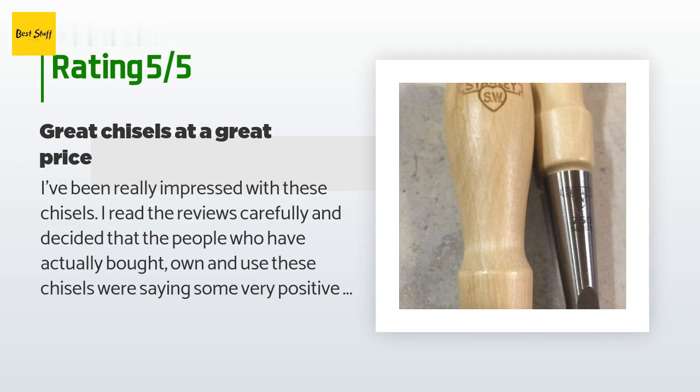I was interested in the basic overall performance and was also a bit curious about how these Stanleys would perform. I've had these chisels for almost two years and they are great. Sharpening is very easy. I didn't choose the Lie-Nielsen version because I didn't want to use the A2 steel — sharpening A2 can sometimes be tedious. The steel in these takes a very keen edge and I get all the edge retention I need for use on domestic hardwoods. Razor sharp is very important to me, more than a little longer edge retention.